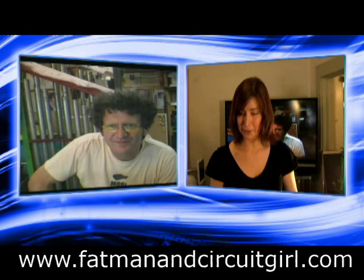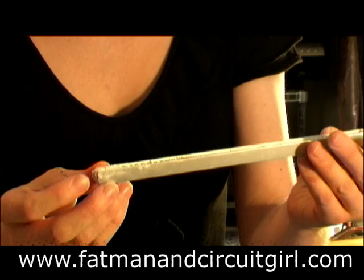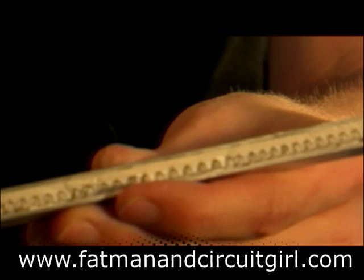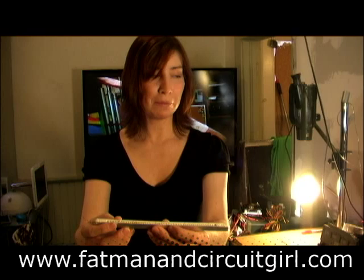Here's a neat little trick for working with plexiglass at home. What you do is take apart a hair dryer and get the heater element out of it. Then you get a piece of aluminum U-channel — I actually borrowed Monty's U-channel as he came in to show how to bend plexiglass. You take some plaster of Paris or other non-flammable, non-conducting material and put it down into the groove. You want the heater element to be below the surface of the U-channel.